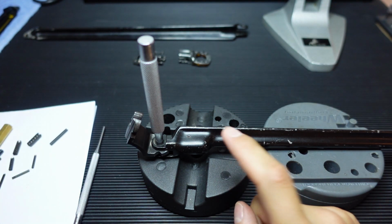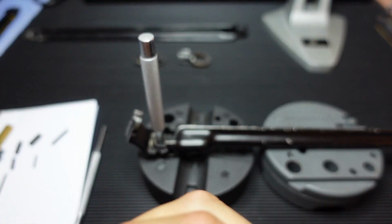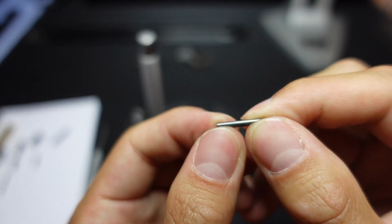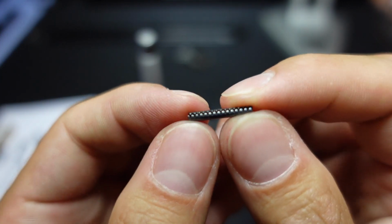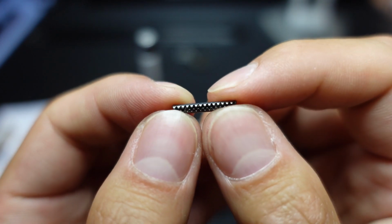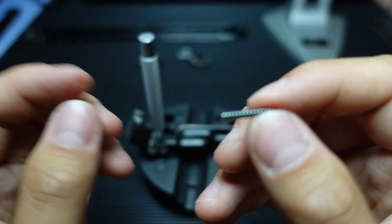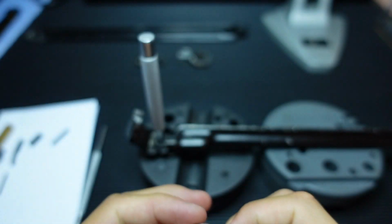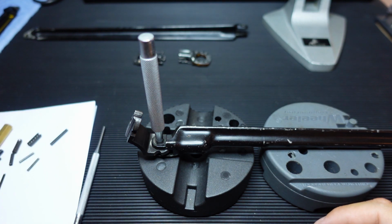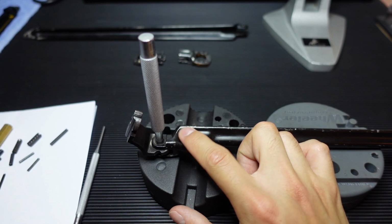In fact, concerning the bipod detents proper, the early pins were simple slotted spring pins, as you can see right here. And there are also later variations that have a little miniature slotted tooth or tooth slotted spring pins. I'm getting lost with all this terminology. So when you disassemble these, you can expect two different variations with relatively different behaviors. So it's important to act accordingly to what you feel when you start drifting these out.